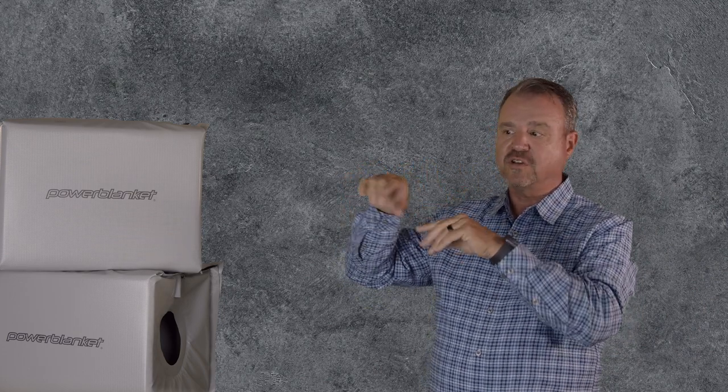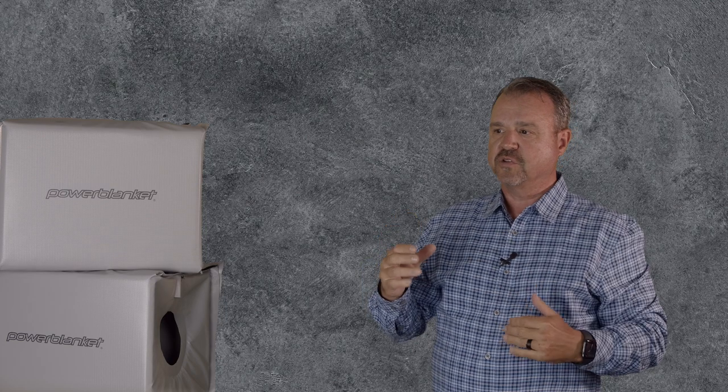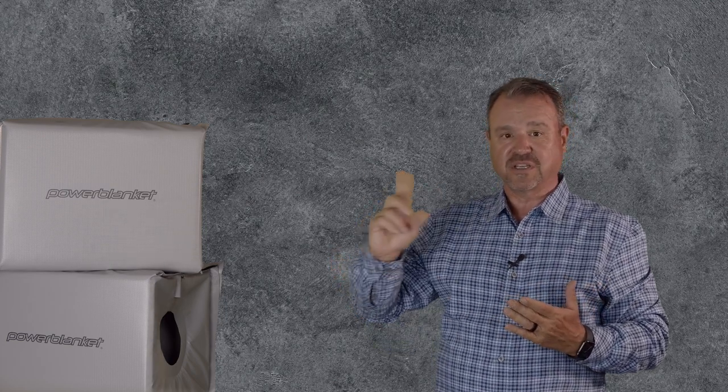What you have are heated wells with heaters on the inside of them, so that when maintenance needs to be done on the heater, you don't have to drain the tank and your process can keep running.